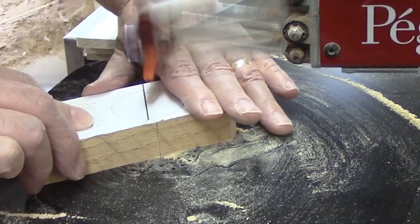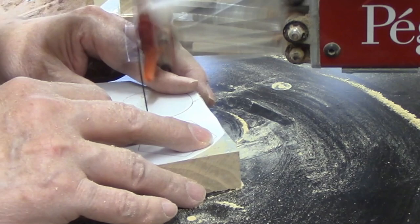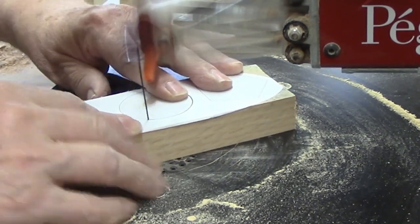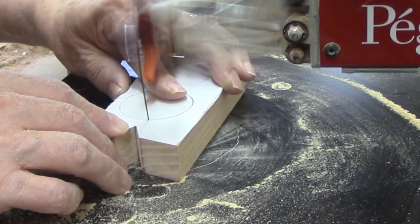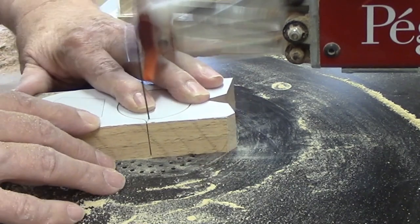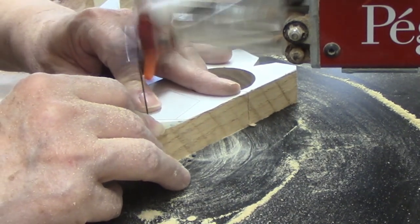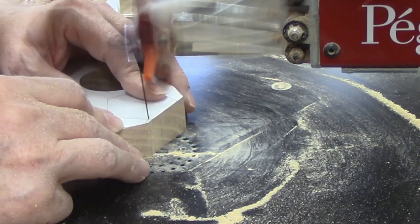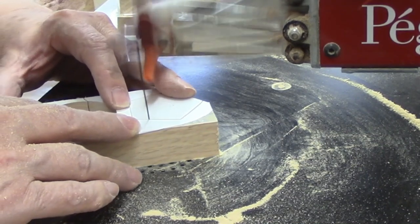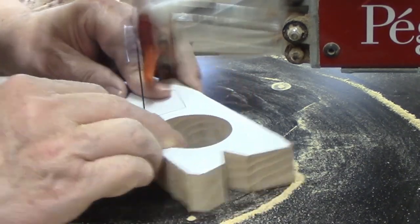The circle was the next shape to make. While there obviously aren't any angles to cut here, it's worth noting that it's not easy to accurately cut a circle. It's easy to leave small bumps or straight sections if you're not careful. The best advice I can give is to keep the workpiece moving steadily, using your hands to keep the motion as consistent as possible. If you goof, making corrections later on a sander is not easy either, so it's best to get it right the first time. The pentagon is the last shape needed for the puzzle. After I finished cutting it, I gave it a test fit against the frame — I was a little surprised to find that it only fits in one direction, as the sides are different lengths, so this shape may also be a challenge for a toddler.